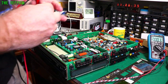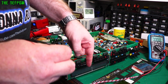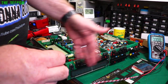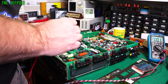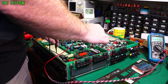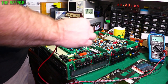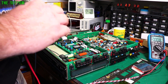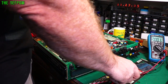So I'm looking at reverse engineering this now and figuring out what I can do for the display. My plan is to use individual seven-segment displays, make a circuit board up, and replace the whole thing with a seven-segment display array using a low voltage drive. Checking the voltages — relative to chassis ground at the junction of the zener diode and R41, I'm getting minus 70 volts. That's one of the supply rails which goes via the various switching transistors to drive each digit and each segment, referenced to minus 70 volts.